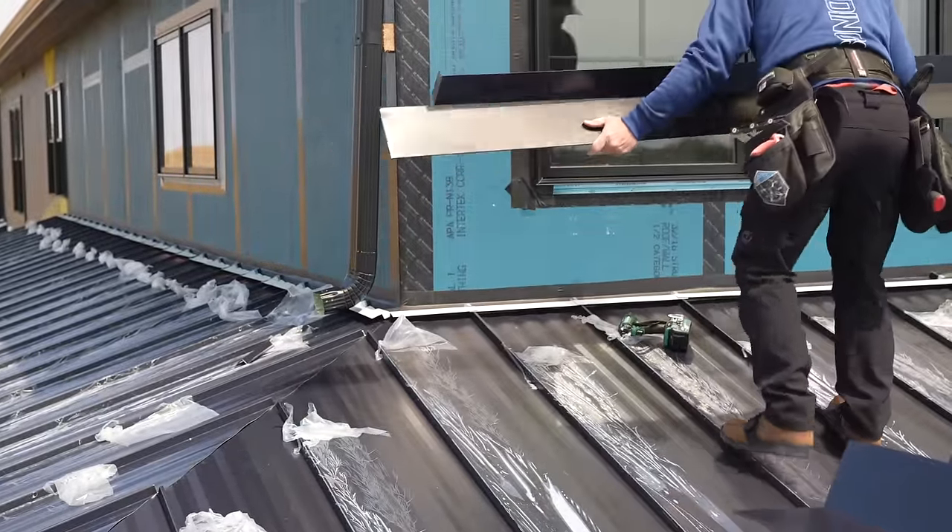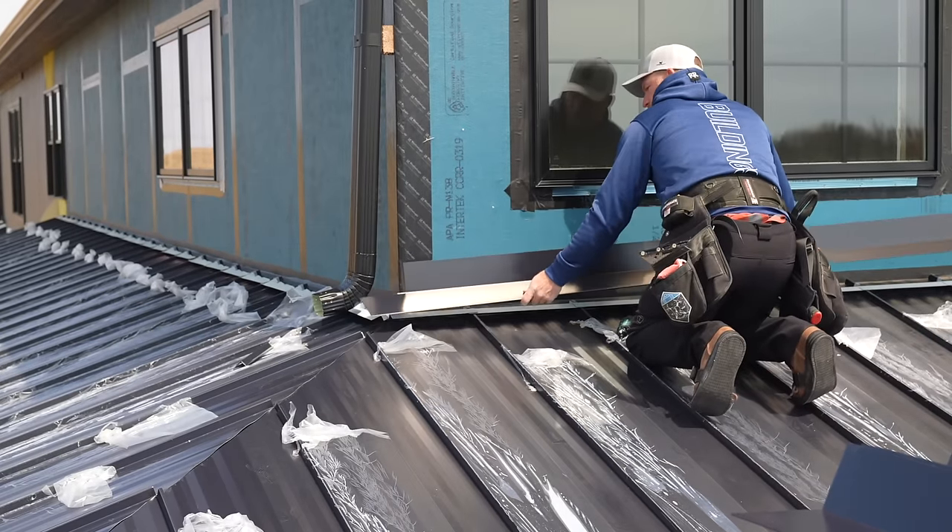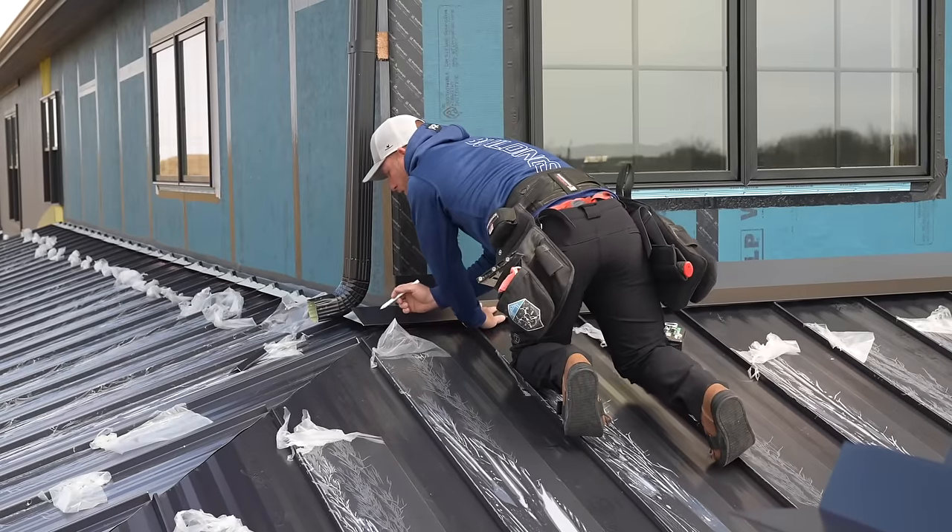The hip cap can naturally flow right over top, and if any water gets behind here — which it probably won't — it can work out the roof thanks to gravity. We can do some details to make sure any water that gets under the hip cap at the top doesn't get down into the hips. This first piece of connection flashing I've got to bend around, and I've left it kind of long for the moment.